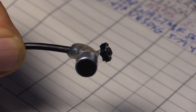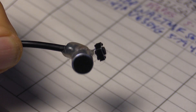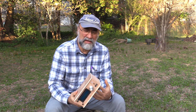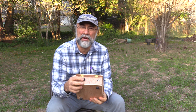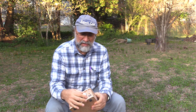The radio even comes with a little condenser element and a micro switch to make your own little microphone with a little bit of hot glue — and it works. The UBITX 10-80 CW Sideband Transceiver Kit from India comes with all the parts you need except for the box, so you can use any kind of material you want. I did add an inline fuse holder — I would suggest that. And I upgraded to a PL259 type connector on the back rather than the BNC. You do need a couple of knobs for the front — look in the junk box.